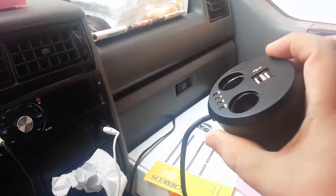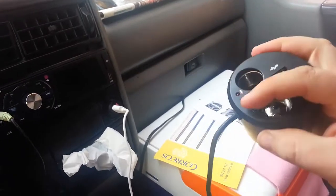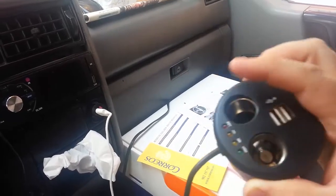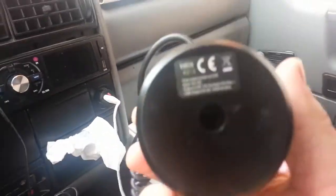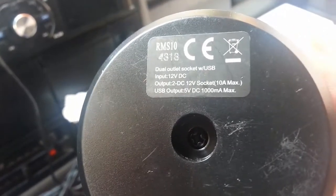This one's actually 10 amps, so it's pretty obvious that this one's a better built one. The LEDs will actually tell you how much load's been drawn off it — if it's too much it will go low when it's getting maxed out. So just be aware, and just check the labels. Check the labels because they'll tell you what the amperage is, and if you see 10 amps max, that's what you're working with.